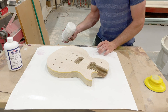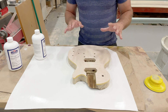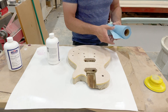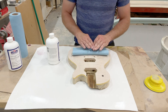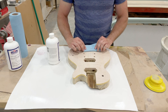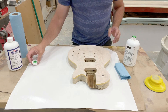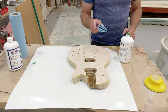So this NGR dye stain — if you haven't seen me use it, you clearly haven't been following me that long, which is fine, welcome aboard. It soaks in quickly. It doesn't go insanely deep because it's a fast-drying finish. A water-based stain will soak in further and thus be harder to sand out — so that might be good or might be bad depending on what you're looking for. This stuff doesn't soak in quite as far because it's solvent-based and it dries almost instantly. It doesn't take much — it's very potent, this stuff. So I'm just going to fold up one of my shop towels here. I highly recommend gloves for this because if you stain your hands, they stain for a while. This stuff is strong.